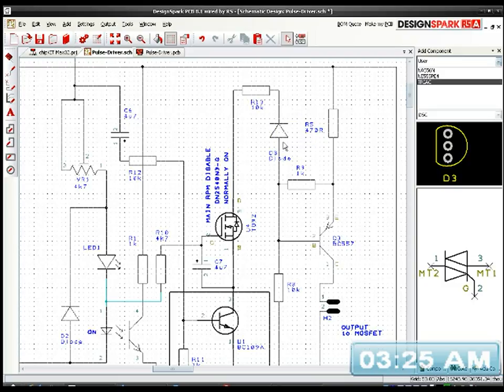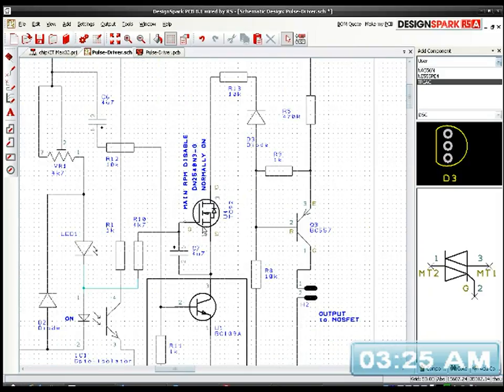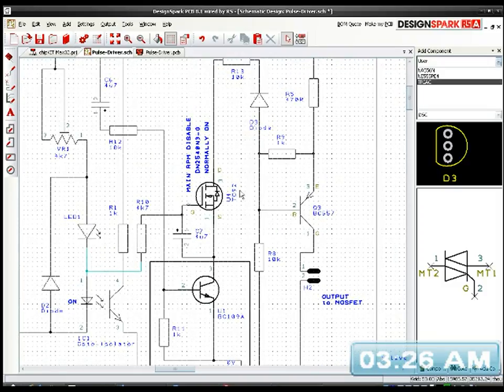So I block that now, because the only voltage that we really want coming is in this anti-clockwise direction up that way. We don't want anything going back, because when they put these diodes in these MOSFETs, it's to protect the device normally. So that's that sorted as well. I'm just going through this all as I'm talking, because it helps me to think it all through as well.